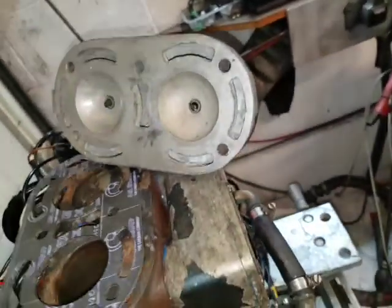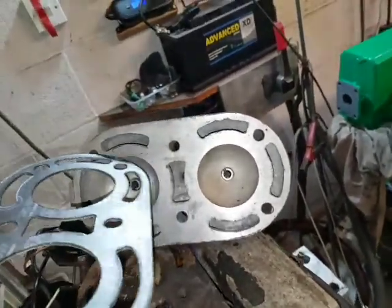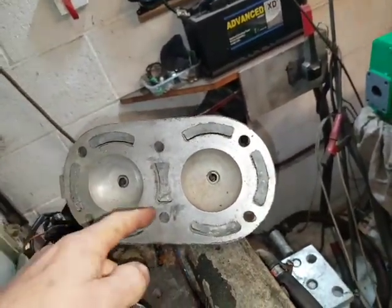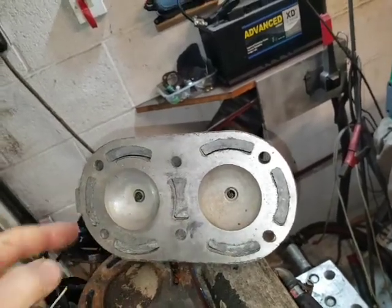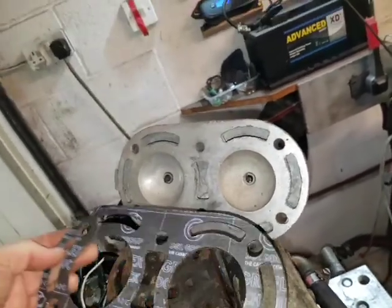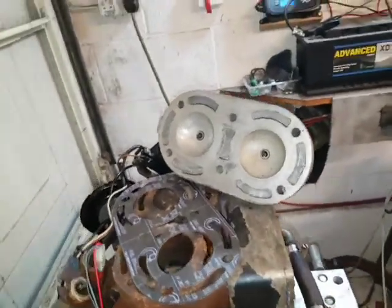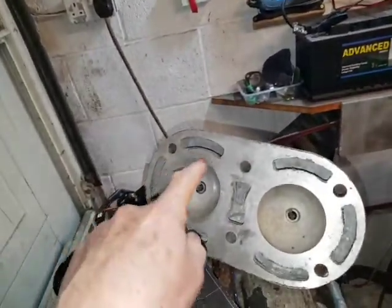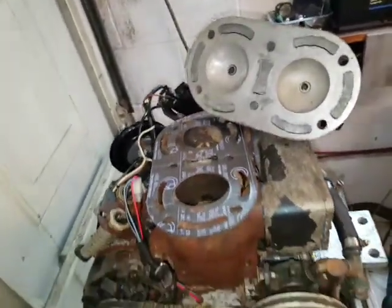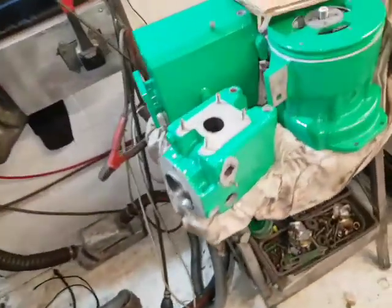So this is the whole weakness of this engine, and why it failed and was thrown out, because even with a new gasket and a new head, incidentally, these are about £500, I understand, just for the head, and there's a load of machining that needs doing, because that's just a raw casting. You then need to get it all machined in various ways. I don't understand that, I confess, but it was the only choice the owner had, to replace the head to solve this problem, and he just didn't think it was worth it, because likely it's going to go again in a couple of years. Now, some interesting comparison with the Vire.